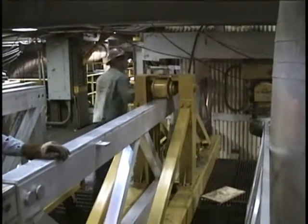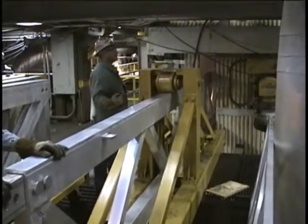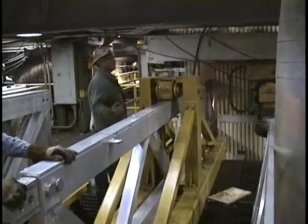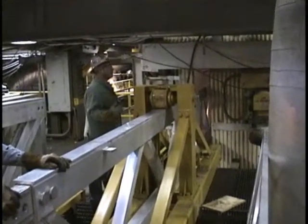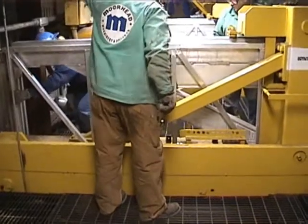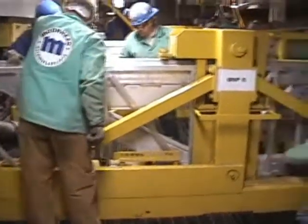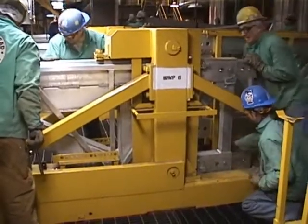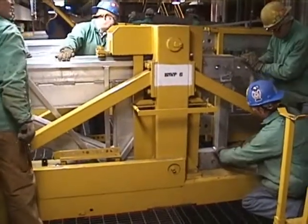Until the next set of cross trusses are just inside the boiler a few inches. The spotter will help by calling down the alignment of trusses status to the call out leader by radio. Any corrections can be made by having single truss rows catch up. Workers can now manually push the forward truss and make sure it's between the side guide rollers and the end is about 12 to 18 inches behind the main roller.